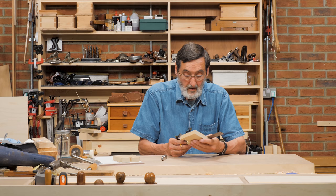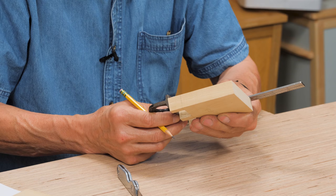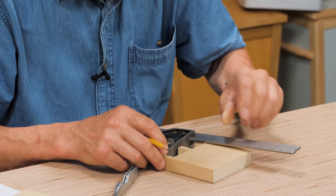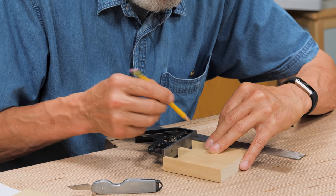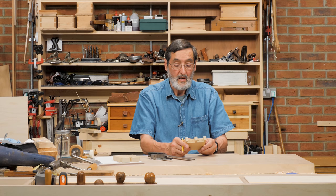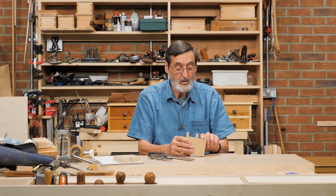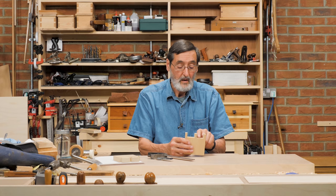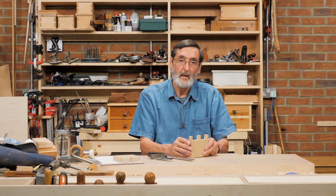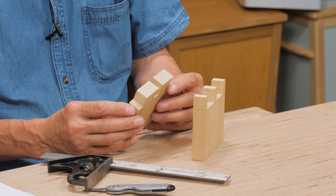This other side isn't really so far out — let me see if I can mark it for you. It's ever so slightly out of square — I'm not sure if this will show — but it's enough that the wood would compress. Jenny, I'm really happy that you sent this in to me. Generally you've done a great job. Pair-cutting the pin recesses at the bottoms — we do do that, and I don't want you to think you should never pair-cut, because there's no saw cut there — that's your chisel work. But on the sides of the pins you should generally try to get them directly off the saw.